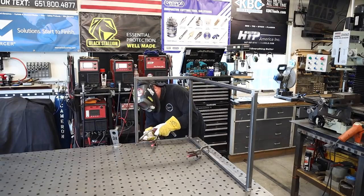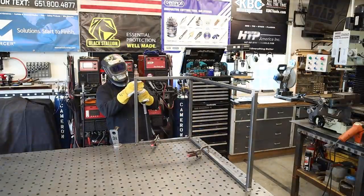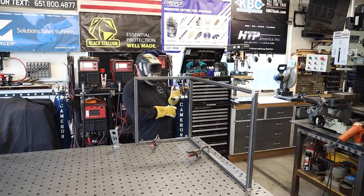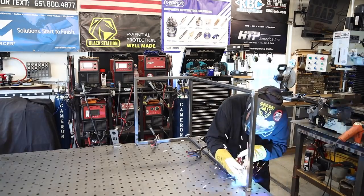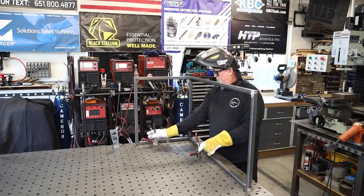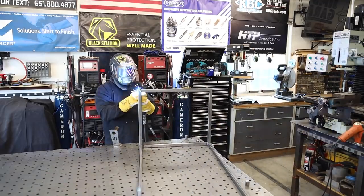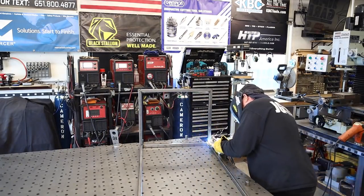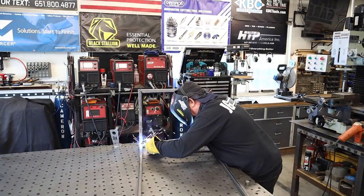All right, so we're coming to the end of part one of this video series, and I just wanted to give you a little recap of what we did in this video. First was cutting and assembling the frame itself, and I can't stress how important it is to get everything perfectly square. You see me dealing with a lot of different squares. This has to fit in an opening, and I'm trying to make it really tight so it just fits right in, so there's no gaps anywhere. So it's pretty important to get everything nice and square.